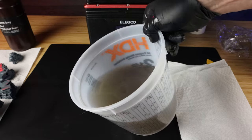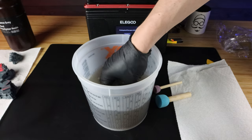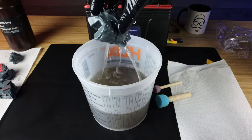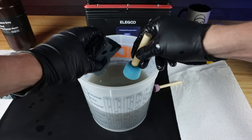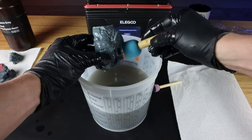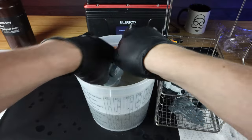Step two: I have a bucket full of dirty isopropyl alcohol. Over time your alcohol wash gets really dirty, and the way to keep it cleanest is to do it in stages. I use a bucket of very dirty isopropyl alcohol to get all of the big chunks of liquid resin off. I put all my pieces in there for about five minutes, then take them out and gently wash them with a little spouncer - a sponge on a stick - and then I slowly dunk them into my wash tank.